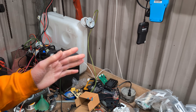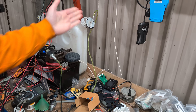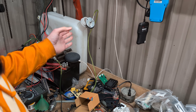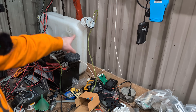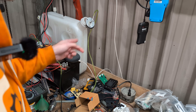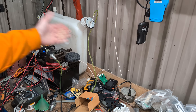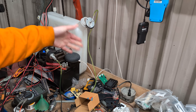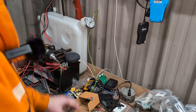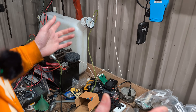Okay, well that was it running on a 50-50 oil and diesel mixture, and it has flamed out because it ran out of fuel — which is my fault because it only ran 1.5 litres through. I'd hooked the pickup over one of the holes so it wasn't sitting down to the very bottom of the fuel tank. It was just barely touching the top of the diesel, so it sucked air. But that's good news — it kept running until it ran out of fuel, which is what we wanted. I'm going to take it apart now and show you what the inside of the burn chamber looks like.